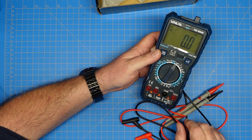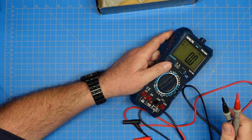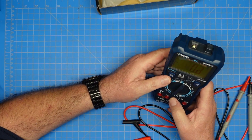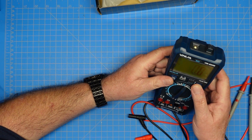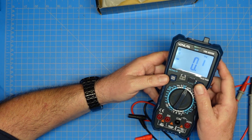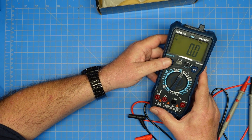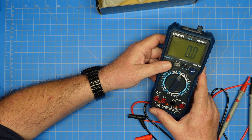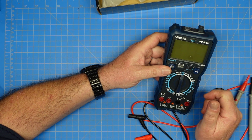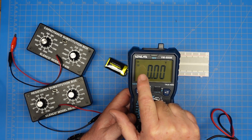I've got batteries in it and you can see the meter. Here are the probes — these feel very solid. These are CAT 3 probes and they have a little protection device on the end so you don't poke yourself. It has a flashlight function which you can get by long-pressing this button — this is also the backlight. Press and hold for the flashlight, which seems pretty bright on camera, and one short press turns it off. We have a function hold which holds whatever reading we're taking. The meter has auto-off. Switching to the DC range, the meter clearly says DC in the top corner.